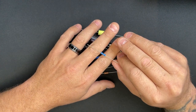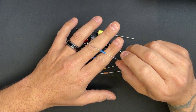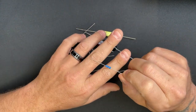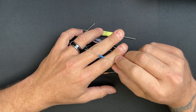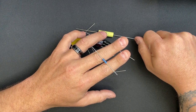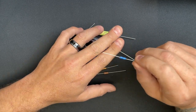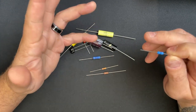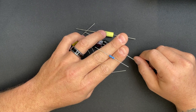I use metal film for the entirety of my amplifiers. I think they sound just fine and there's nothing wrong with them. I cannot justify using any other type of resistor because I haven't found any empirical evidence to show otherwise. Metal film is more temperature stable, more accurate — usually 1 to 2 percent tolerance — and more stable over time, holding its value 10 to 15 years from now.